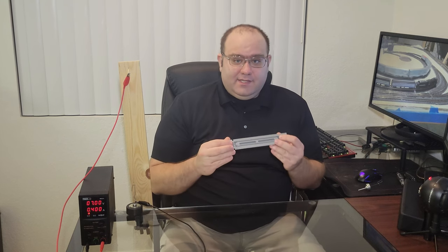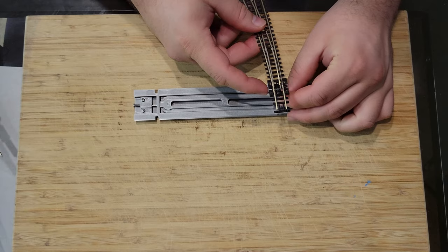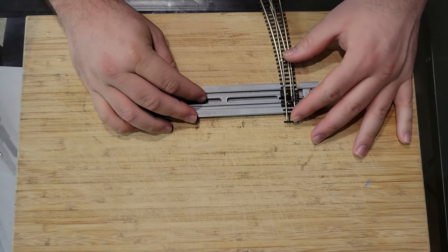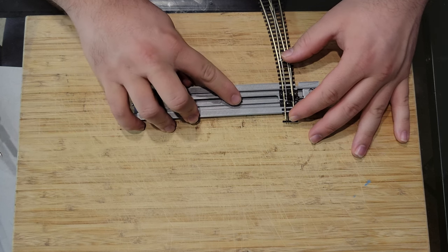To fine-tune the system, I made the wire mounts adjustable by a screw. Now, you don't have to use adjustable features like this in your design, but it does help account for some of the errors you may have when hand-fitting parts, which is basically everything in this hobby, so maybe a good idea. The slider is then placed under the table. We'll have a music wire attached to the slider that will manipulate the turnout above.